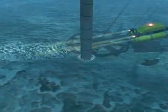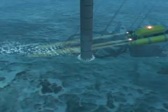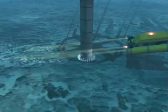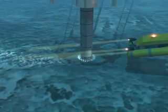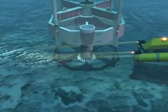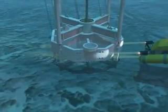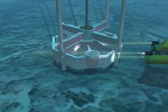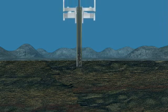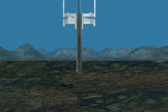Whether jetting the structural casing into place or running it into a pre-drilled hole, the casing and PGB system are installed using a running tool connected to a running string of drill pipe. For jetting operations, the casing is lowered into the seabed while seawater is pumped from the drilling vessel through a drill string installed inside the casing down to a jet head, positioned a short distance from the bottom of the casing. As seawater exits the nozzles, or jets, of the jet head, the soil core accumulating inside the casing pipe is flushed upwards through the annulus between the drill pipe and the internal diameter of the casing.